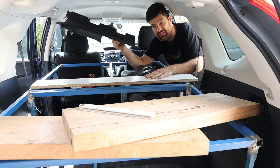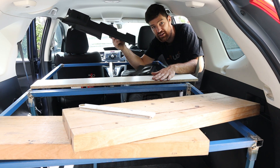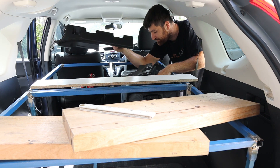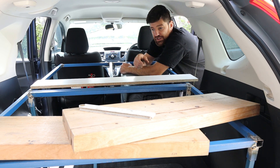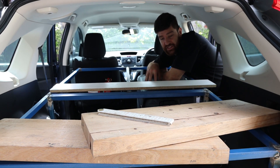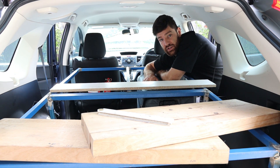I've got this piece of timber here just to mimic the timber that will end up on top, and I'm trying to measure the gap between the top of the fridge and the bottom of the plywood. Whatever amount I can chop the legs down to drop the bed by, I'm going to do that — get the plywood as close to the top of the fridge as possible. To access the fridge once the bed's on top, I'm going to do the plywood section in four pieces, so we can lift one of the four panels off as needed.